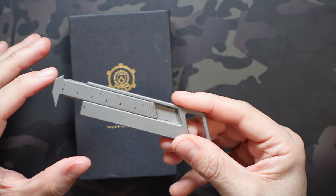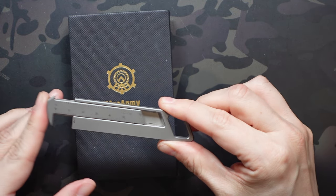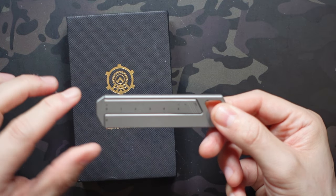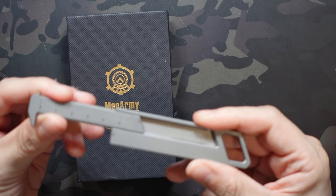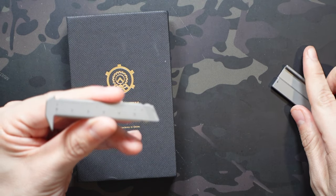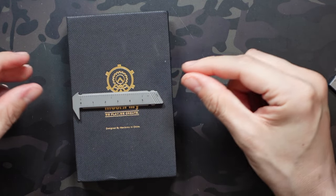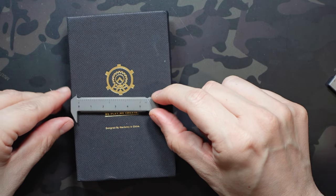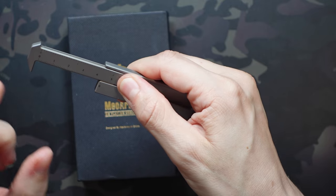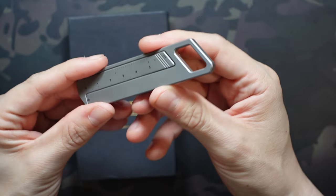The calipers are also great for measuring rounder items as well as small square items. Sometimes you need to lay it flat and measure something on the table — that's perfectly fine if you don't have it on a keychain, but if you have a key ring on here that's going to prop it up and keep it from laying flat. You can actually remove the slide despite the zero screw construction — it stops at a point, but once you put some pressure on the threaded lines you can slide it right off and use it independently. When you're ready to put it back, just reverse the process, slide it in, put a little downward pressure to get past the stopping gate, and push it closed.